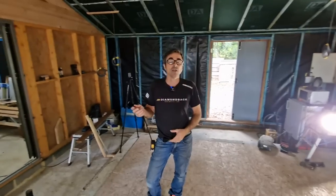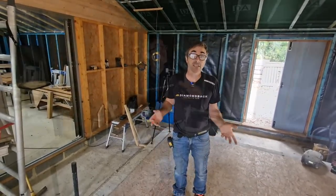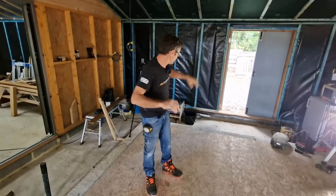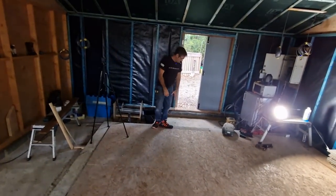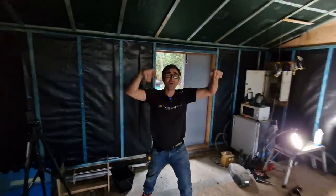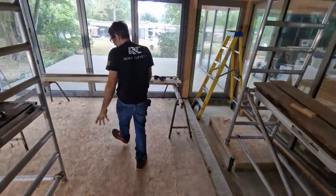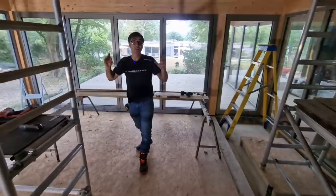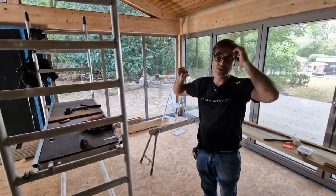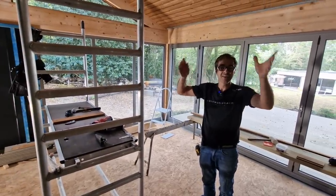So it's quite a lot of material when you consider this cladding, for example, is the best part of £5 a meter. So we're gonna get on now and get this side brought all the way down as far as the wall position, which is where I'm standing. This is gonna be the wall. The wall is formed from the floor that we're standing on right here. All of this OSB, 18 mil OSB, is on joists. Those joists become the studs. The OSB becomes grounds to fix everything to. And that'll be our next job once we've got the rest of this ceiling finished.